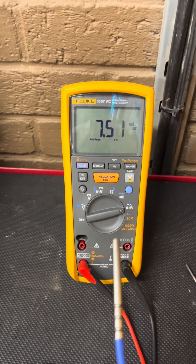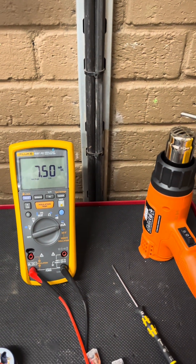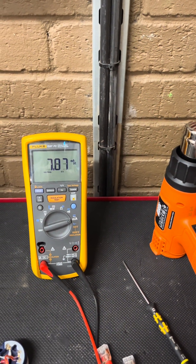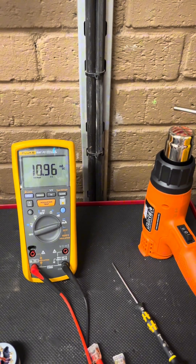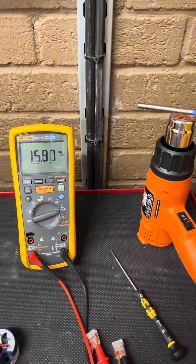I'm going to put it on a known heat source just so you can see the milliamps going up and down. With the working ranges of most temperature sensors, the milliamps will work out as follows: four milliamps would be zero degrees, and if it went up to about 300 degrees on the sensor, that would be 20 milliamps.